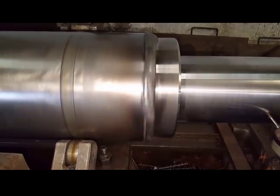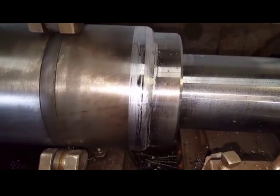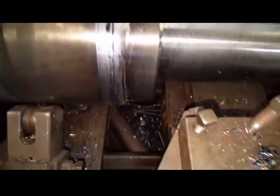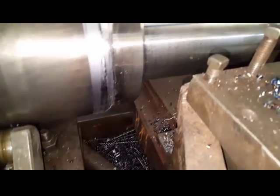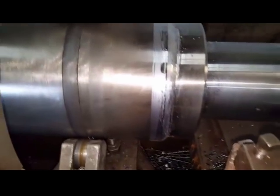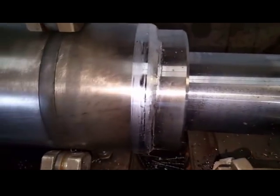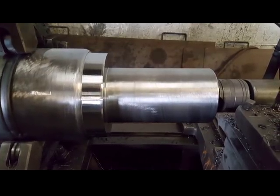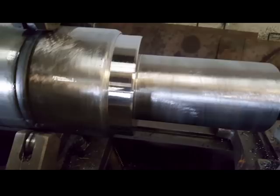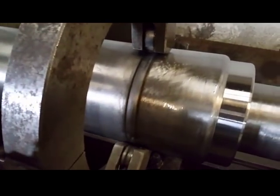Clean this weld up. Well, that's half tidy so far. I did it with the 45 tool, slowly angling it round, only tightening down on one stud, but it held okay. I'll clean this part and then turn the shank to size, then dress it up. That's the shank finished to size, the weld cleaned the best I can. I'll just get a final polish on the body now, get rid of these roller marks.